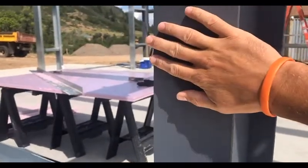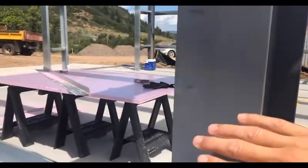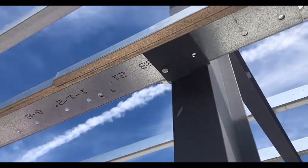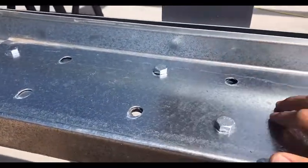The reason this is done is just the way these are fabricated. Sometimes they'll twist under heat during the welding process, and in the fitting shop they're not always perfect. So four holes are put in, and it makes it pretty easy to line up two holes.